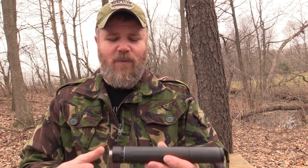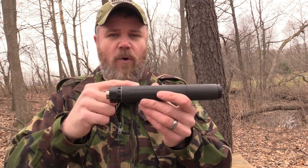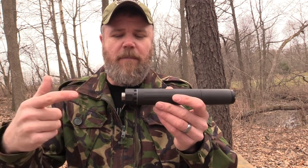That's all changed. Nowadays we have precision machines that make baffles with a bore so perfect that the bullet can pass freely through them, coming so close without touching that it seals the gas behind it. You still get a little bit of gas that follows the bullet out the end of the suppressor, and the wipe in the case of the 45M helps to mitigate that gas escaping.